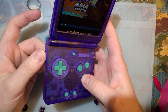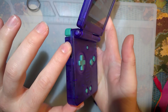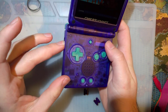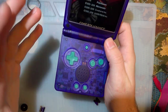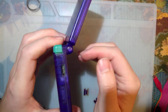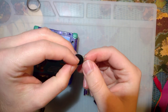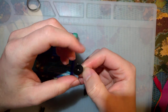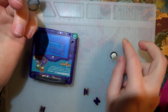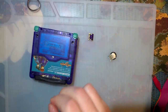This potentiometer in particular is salvaged out of the Game Boy Color, and it does work perfectly fine, except all the way up. The potentiometer itself is just a little bit crusty. On any other console I would just replace the potentiometer and call it a day, but because this SP isn't even using the correct potentiometer, it's going to be a little more difficult. What I did — I went and found these on AliExpress, just replacement potentiometers. I haven't tested this one in particular, but hopefully it works just fine. The specs look great, and I made some PCBs, so maybe I won't have to wire this up.